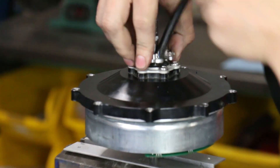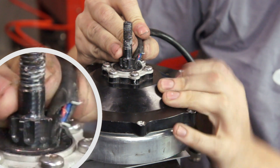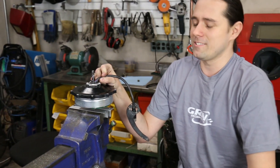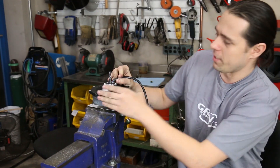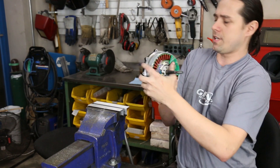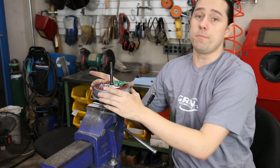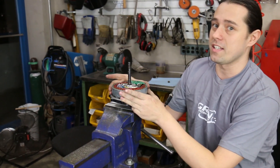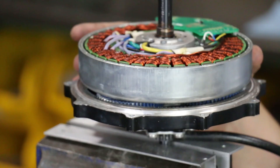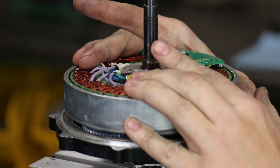The damage on this cable is certainly not repairable in situ — this cable will have to come out. Getting the cable out is easy enough; getting the new one in, well, that's where there are a couple of useful tricks. We're going to flip this motor around and take a look at the other side. This GMAC motor is an excellent example of the worst-case scenario when it comes to motor cable replacements — larger hub motors are pretty effortless by comparison.